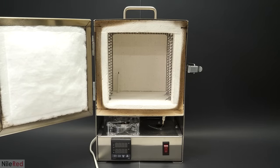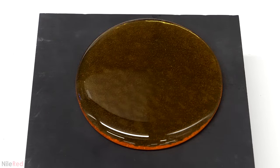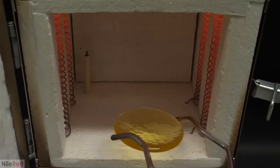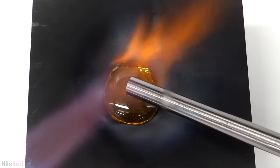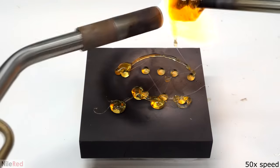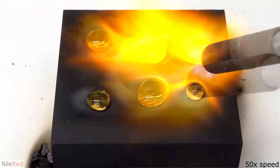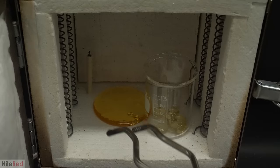I still really wanted to make a big disk of it, so I melted the rest of the powder and poured out another one. Then, as it was cooling, I quickly changed the furnace temperature to 450°C and put it in to anneal overnight. In the meantime, I collected all the broken glass and melted it with a torch. I wanted to try some glassblowing with it, but I had no idea what I was doing and it was a total failure. Instead, I just made several beads that I thought were small enough to get away without annealing. However, at the last minute I got the idea to anneal them just in case. I knew it was a bad idea to open the furnace, but I did it anyway — and it was a bad idea. Where the beaker touched the disk it started forming a crack, and cracks formed everywhere that I touched.